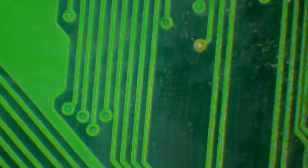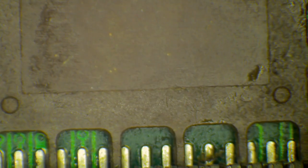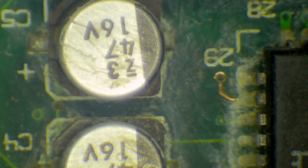So first of all, I want to remove a capacitor without using a hot air gun. Let's say I'm going to remove this guy here, 47 microfarad, 16 volt. Now, this solder here is old and crunchy and crusty, and you might find that as soon as you apply some heat to that, it just goes rock hard and black. So the first thing I would do if I was wanting to take this off without a hot air station is douse it liberally in some flux.